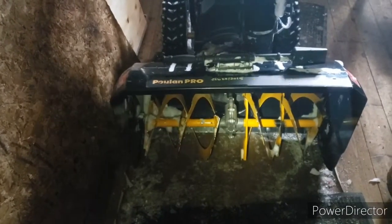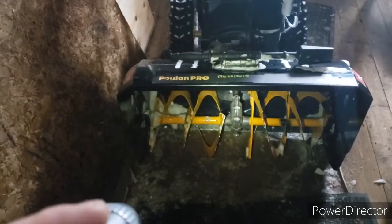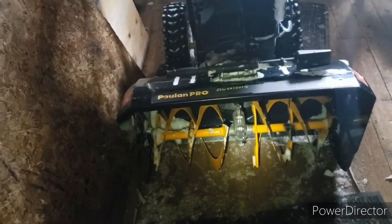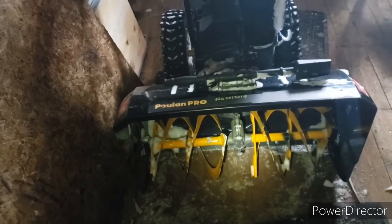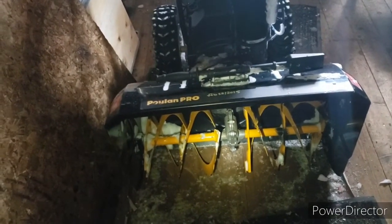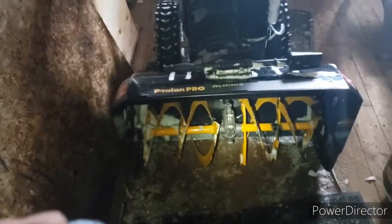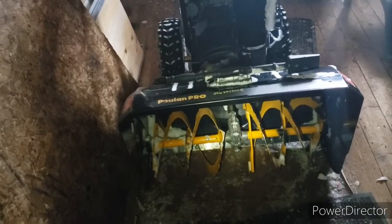I could have put a new impeller on there, but I figured I'd try this first. I just drilled two holes, put it on with 1/16 inch clearance. I was thinking that if there's water, it could freeze — the less clearance you have, the more likely it is that water will touch the rubber and freeze. Usually when I put away the snowblower, I let it run in the shed for a minute with the auger going to clear everything out.